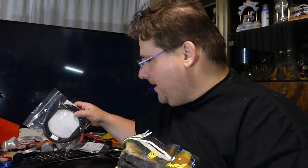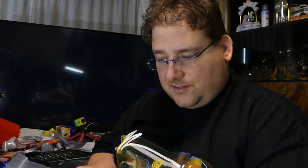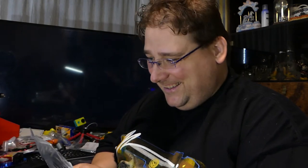The downer of the batch turned out to be the best of the batch — it's weird. I'm hoping this is cheap, because I might want to buy more of this. This is Land Filament — they literally take garbage from the landfill and mix it in with PLA, so this is a municipal solid waste mixed with PLA. I was pleasantly surprised: first, it prints like freaking butter. It prints like eSUN PLA Pro. That first layer was like glass — it went down so smooth. I was very impressed by how nicely it went down.